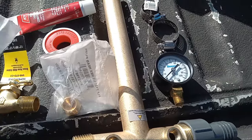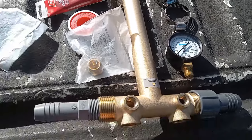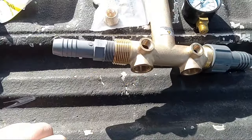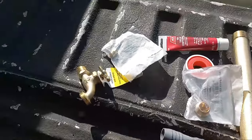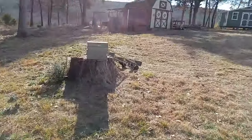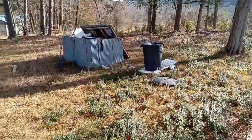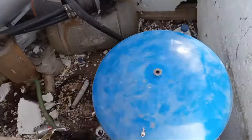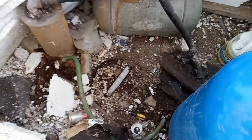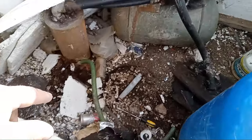The only thing I don't see — I thought I got a pressure relief valve, I don't see it. So we're gonna get all this together, get it in there. Before I put it in I'm gonna put some gravel in there and level it off, put these blocks on the bottom so it's nice and level. I can't get all the water out of this tank and I can't get this old tank out, so I just moved it all the way to this corner. The new tank's going where the old one was — that galvanized pipe rotted out because it was directly in the ground.